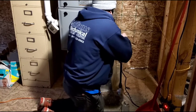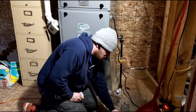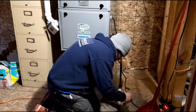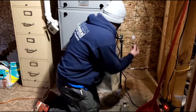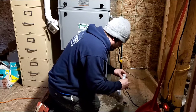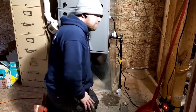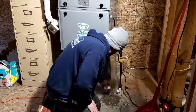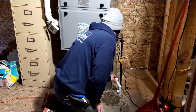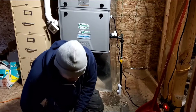I'm gonna just put the T right there. One tool I did forget was my level. These fittings I like to glue both sides. The reason for the T on the top of this is actually for a vent. We've got a couple 45s — I always measure them out, but first off let's get a big piece cut.